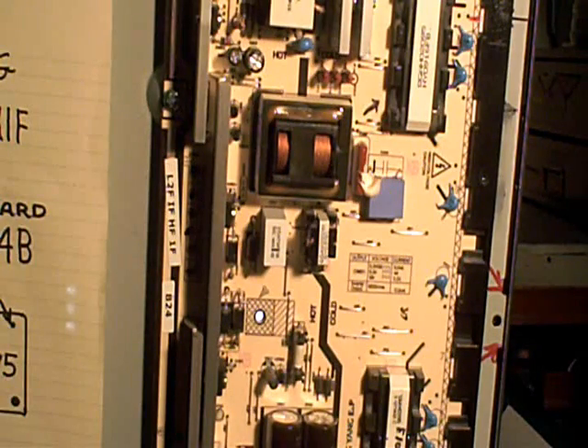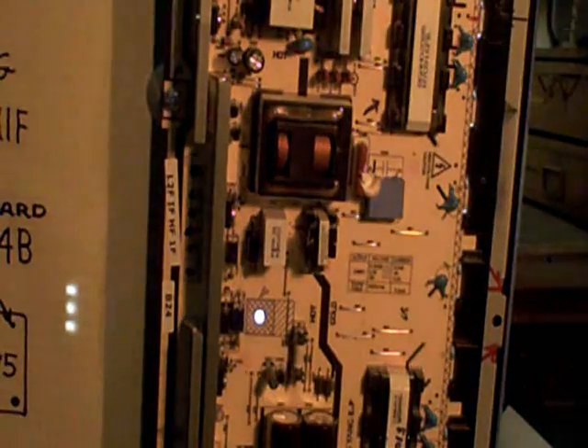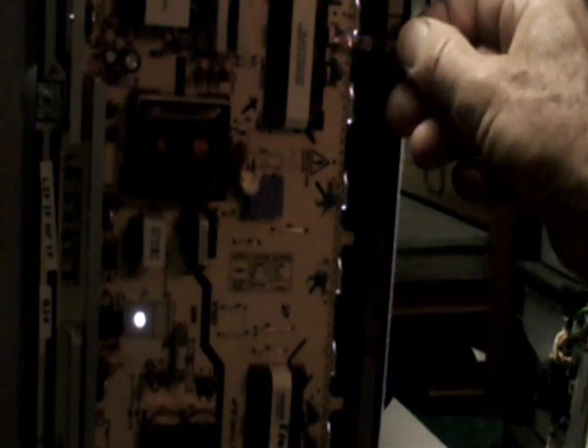Here's a technique I'd like to share. Sometimes you want to take a peek at what kind of voltage you have coming out of your transformers but don't have a fancy meter. If you happen to have a neon light, you can just hold it right on the transformer. If I hold it near the output or even on top of some of these capacitors, you can see the neon light lighting up. That can be a useful troubleshooting technique.